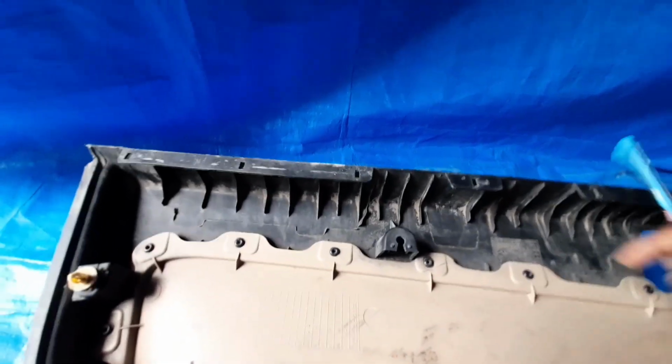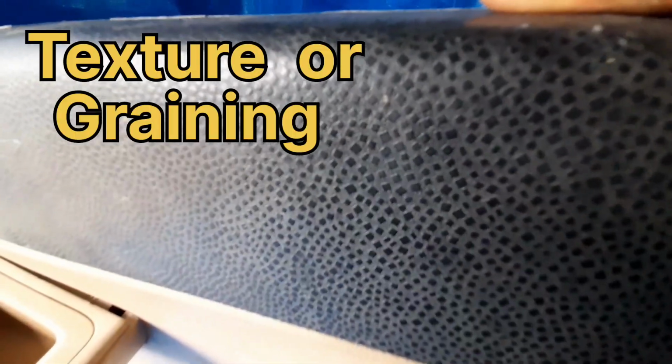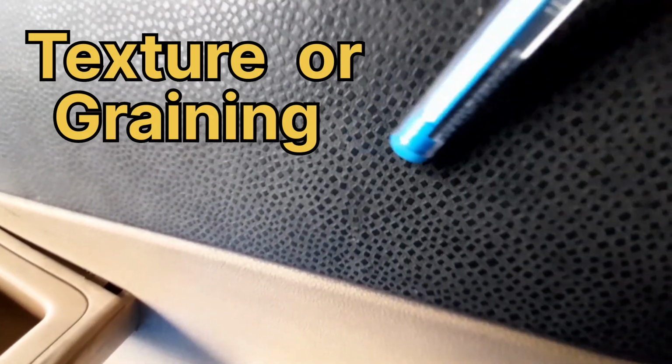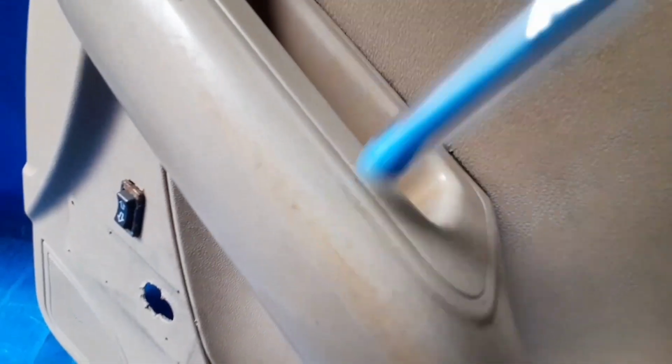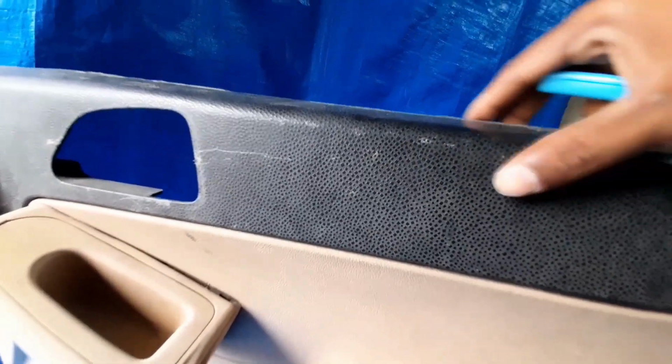Color is black, and the finish from A side is the, see, this one is the textured finish, you can able to see. So this one we can say as a graining or the texturing. It's not a shiny, na? If you see like this, so if you see this one, so this one is the shiny and smooth part. If you see this one here also, some kind of texture is given. So same, this one is the texture, and it's having the graining and texture pattern. So depends upon this pattern we have to clear. This one is in draft analysis from 3 degree to 9 degree or sometimes up to 12 degree also, how the fine and coarse or dense or depth texture is there in microns.